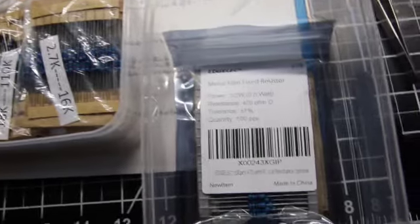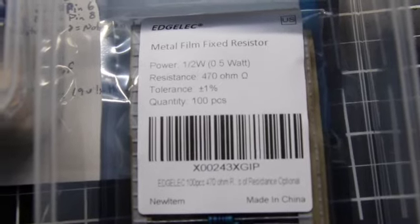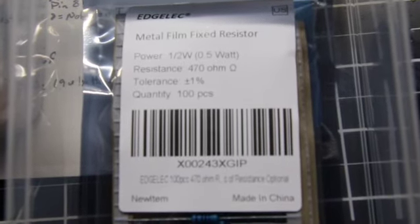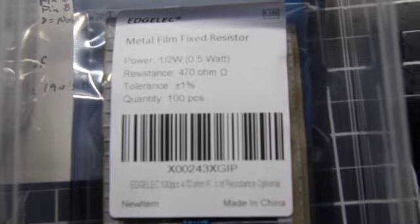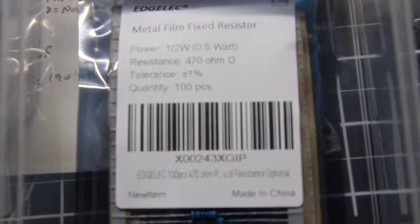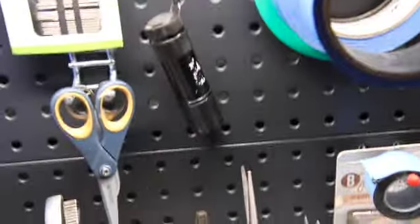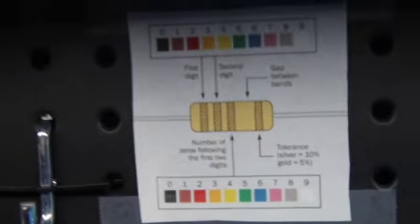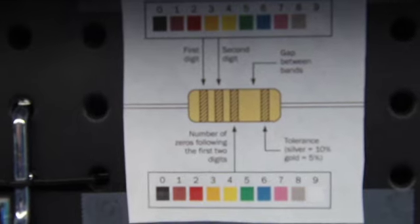And then as far as getting a single pack of something that you would use heavily, I keep a single pack of these 470 ohm resistors because they're the most typical way to bring down the 9 to 12 volts that we typically use when we power up models, for example, off a 9 volt battery, or 9 or 12 volts off of a plug-in adapter. For those who are interested, resistors have a color coding, so you know what is what from the color coding. Hopefully someone has labeled them all like those assortments I showed you, but there is some logic.